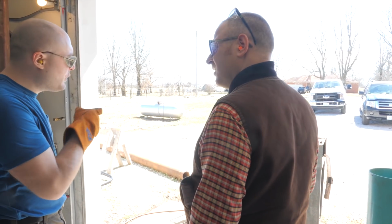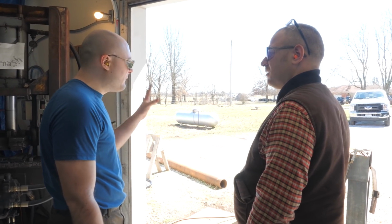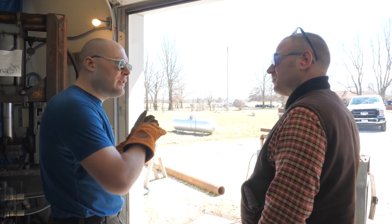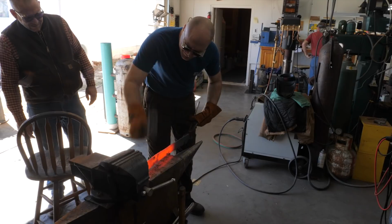I will say when you go to forge your blade, you want to be nice and gentle with it. Don't forge it more than 70% to shape at most. The more you forge it by hand, the more it's going to distort the pattern. Okay. Keep your mind on that while you're forging out your blade. Just forge it all out equally. Don't focus on one spot real hard and then move on. Okay. It's okay to grind more. Yeah, yeah.